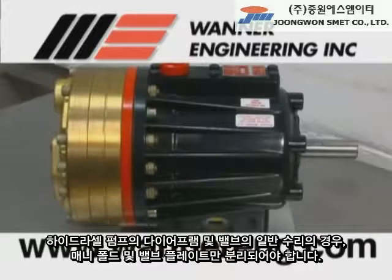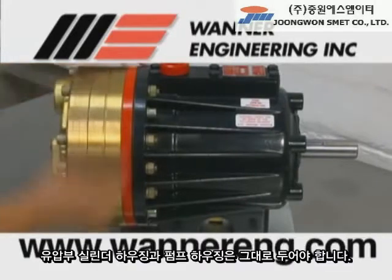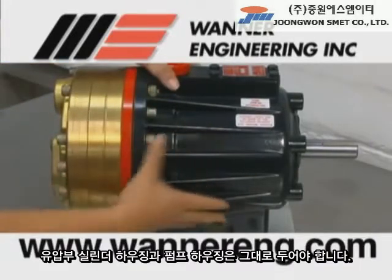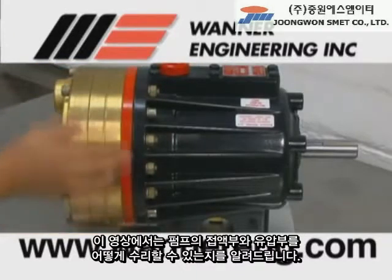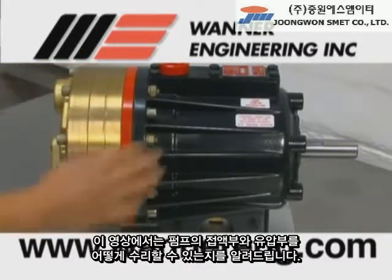For general service of the diaphragms or valves of the Hydra-Cell pump, only the manifold and valve plate will need to be removed. The hydraulic end, cylinder housing, and the pump housing will stay intact. In this video, we will show you how to service both the fluid end of the pump as well as the hydraulic end of the pump.